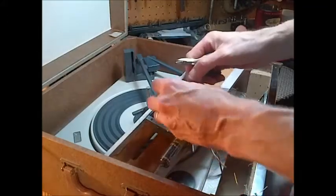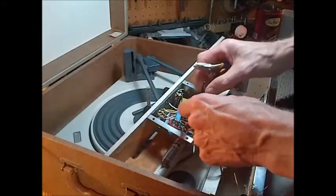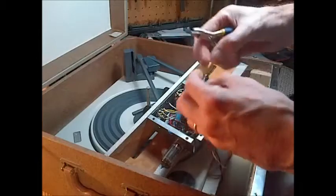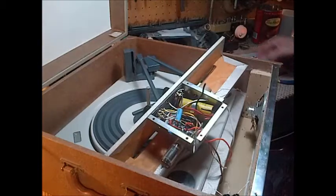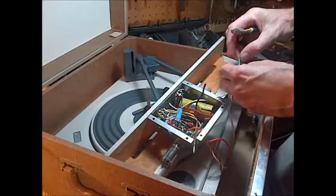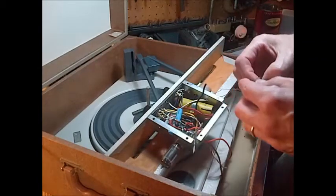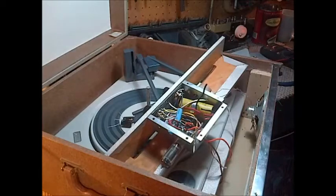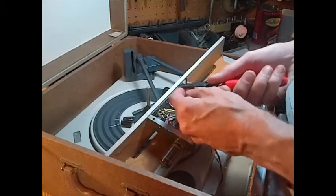The thing about these two is this thing's high voltage is fairly well hidden by these insulated wires, so contacting high voltage isn't so likely — although it's right here. When I put this guy in, these long leads with high voltage on them kind of flopping around in there — I don't want that. So I like to put some spaghetti tubing on the connections. I also like to make them as short as possible — we'll shorten them right up and connect the red wire tight to it to save on the tubing.